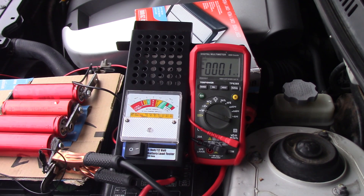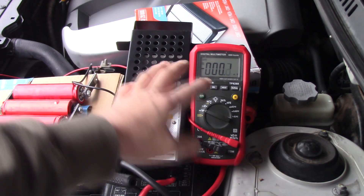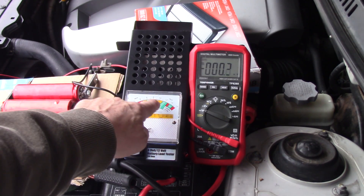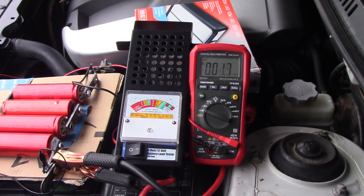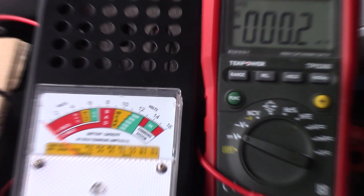Here's my setup on the 38-120 headways. Using the steel bus bars, I'm connecting it to my Santa Fe V6 3500 engine. As you can see, I have a digital meter and an analog meter, both reading zero right now because they're not connected. I'm going to connect that up, then start the car, and you can see the voltage drop with the steel bus bars. The analog is here and you can see the numbers at the top. I'm going to zoom in on that, connect it right up, start it up, and you'll be able to see these meters reading the voltages.